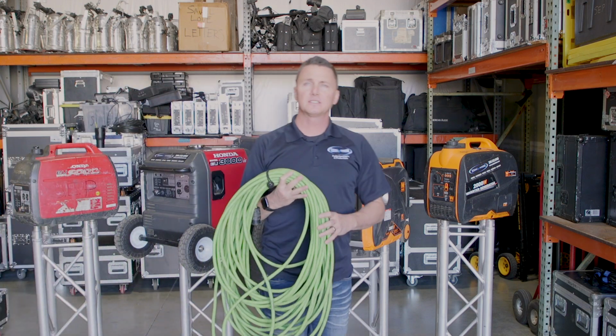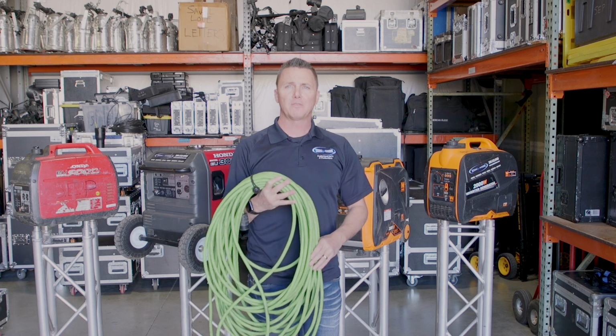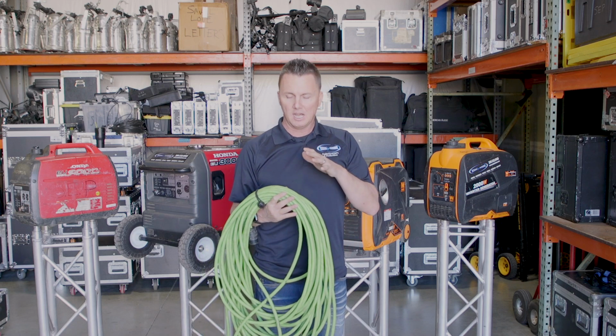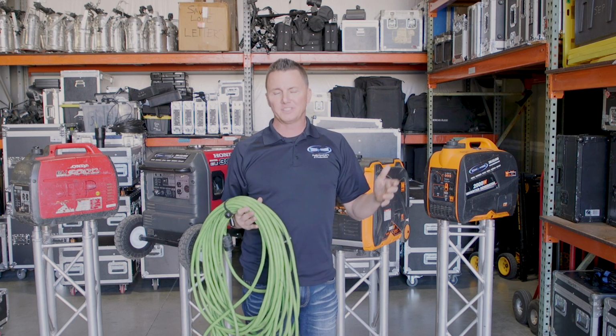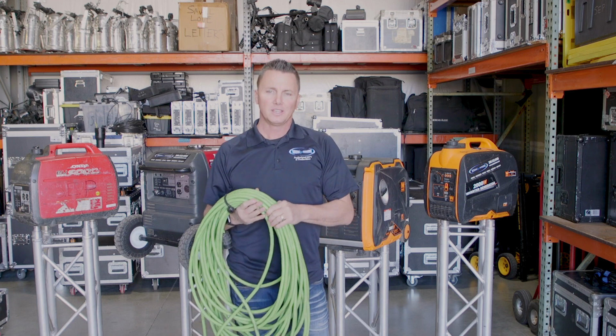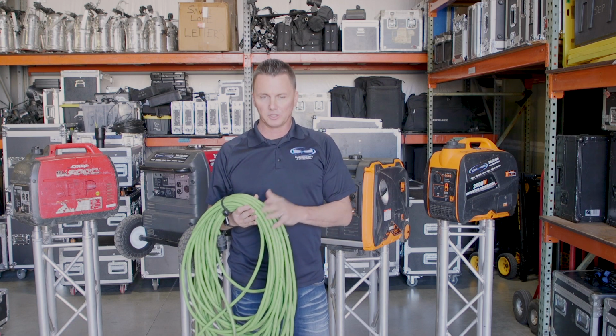But the most common use for us is ceremonies. Our remote ceremonies, they're on a field, they're wherever, 300-400 feet away from power. We can run one of these generators, and we recommend about 100 feet away. So a 100-foot 12-gauge cable is usually what we'll run, something like this. This is the only colored cable I have in our inventory. All of our cable is normally black. Sometimes on these generators, we'll run this 12-gauge because we actually do want people to see it. It's a little difficult to cable ramp on grass and in the weeds, so we'll use the bright cables. Definitely want to do a 12-gauge for that long of a run.